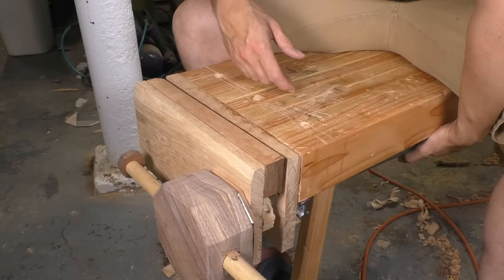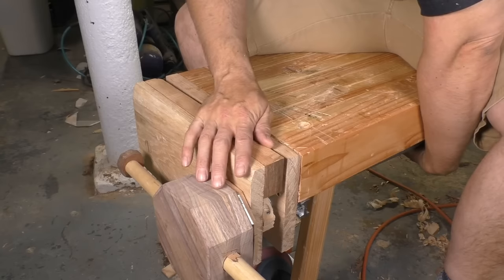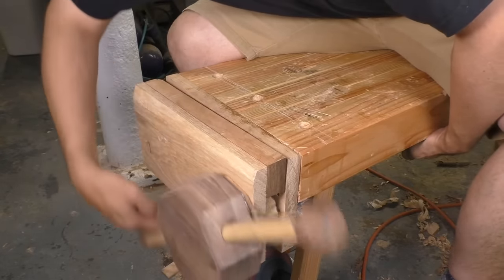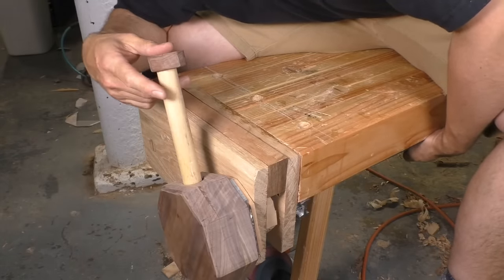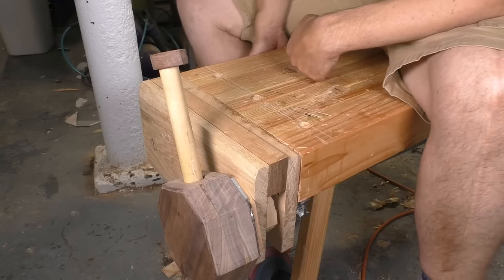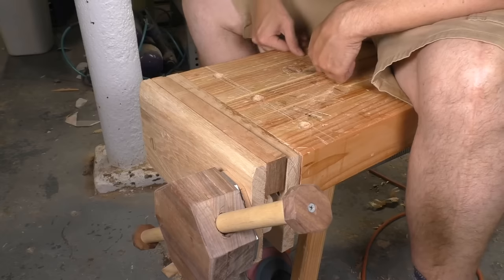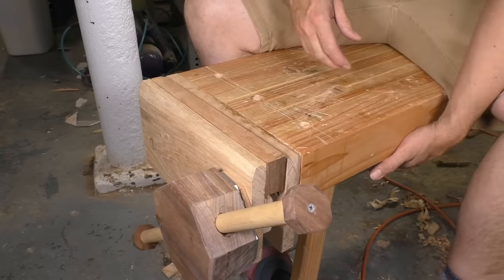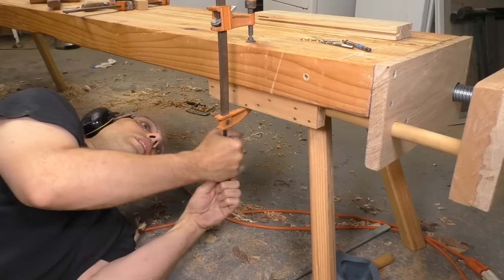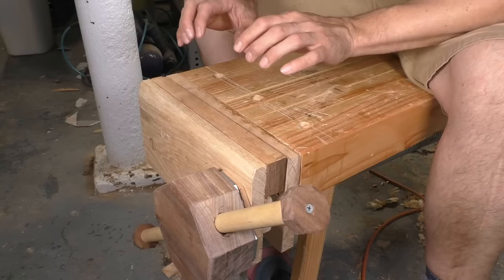The first problem you might have is that the screw is so long and only being held at one end — the back end sags really significantly, which makes the vise close very roughly and makes the jaw pop up. But watch what happens if I just apply a tiny bit of upward pressure — all of a sudden the vise opens and closes much more smoothly and a lot of that rattle immediately goes away. Now as far as racking goes, that's why we have the guide rod installed on the side. To fix both of these problems, I'm going to put a little block underneath this screw to give it a tiny bit of upward pressure, especially when the vise is mostly closed, and another block next to this guide rod to provide a tiny bit of inward force. That's going to fix a lot of the racking and make the vise operate much more smoothly.